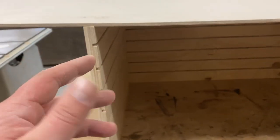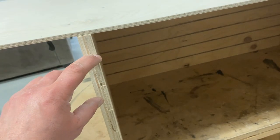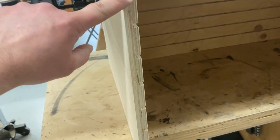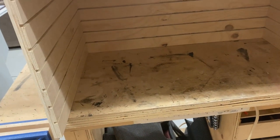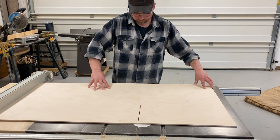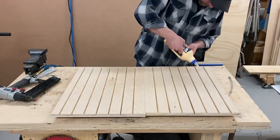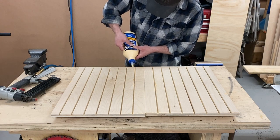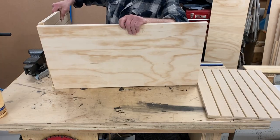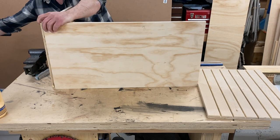This is temporarily clamped up. We're going to put a top on it — I already took the measurements. The clamp just helps keep everything square while we glue. I'm not going to put a bottom on it; I don't think it needs it. Actually I've got this flipped upside down because of that little boo-boo — they'll be able to choose whether they put a shelf in here or not. If they have a lot of blue paper they might just omit a shelf and give themselves one large space. Let's cut to size, glue it all together, and keep rolling.